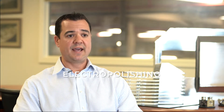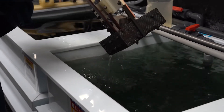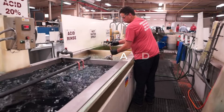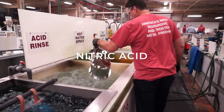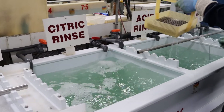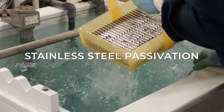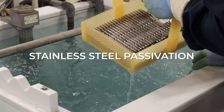A common question that we often get asked is: can electropolishing accomplish passivation? And the answer is yes. Passivation by definition is the removal of free iron from the surface of a part. Electropolishing will remove free iron, deburr parts, and deeply clean parts as well. There are multiple processes that can help to achieve passivation in stainless steel, including nitric acid passivation and citric acid passivation. However, scientific studies have shown that stainless steel passivation through electropolishing is the most effective means of achieving passivation.